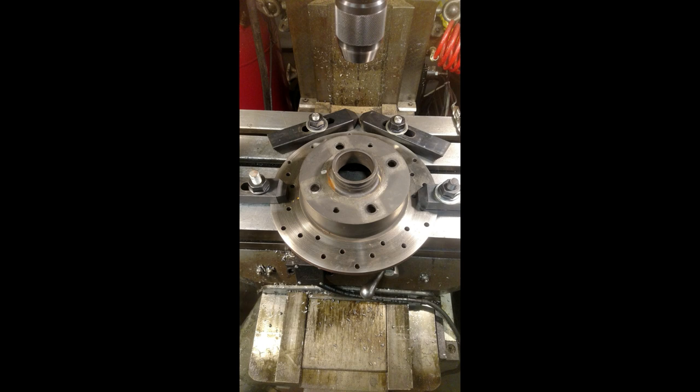In this case I had four pieces to do. A friend of mine from work was modifying his car — it's either a Lotus Elise or an old MG and he was changing out parts to a Mazda Miata — so I needed to drill to a different bolt hole pattern for the wheels. Even though I had that V block made out of step clamps, I still wanted to make sure that the bolt hole pattern was totally centered over the wheel, so I dialed in each piece individually. The step clamps actually made it a little bit easier because I was already somewhere in the vicinity of zero.